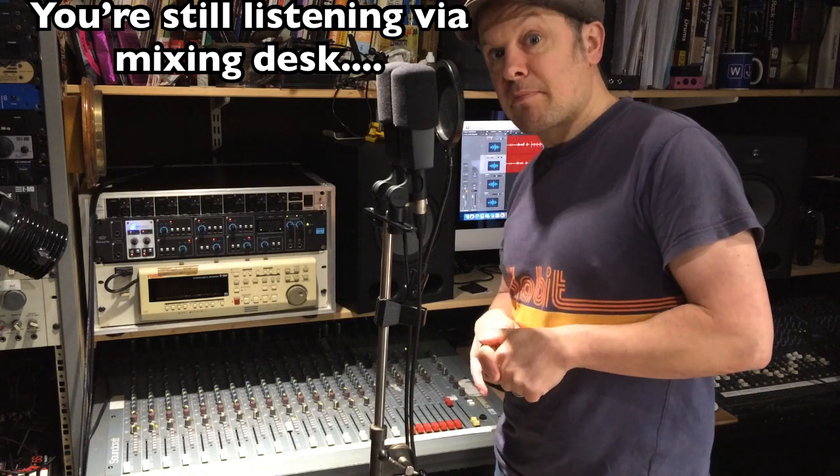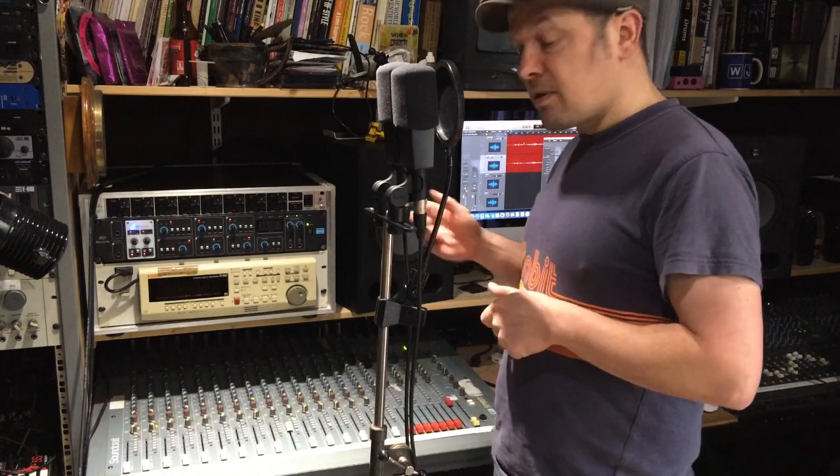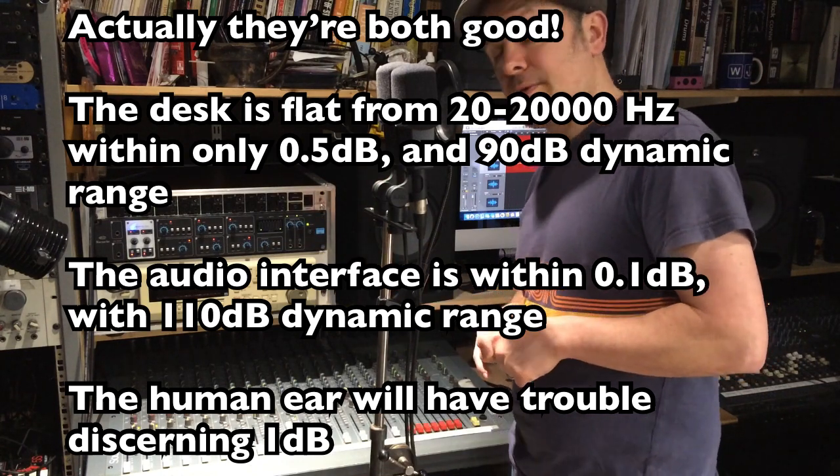When you heard the 24 dB amplified version, you may have heard a Hercules aircraft over there somewhere. But that's the other thing — I'm in my studio, which is reasonably good at insulating sound. Really, to hear the difference between the noise floor on these two things requires careful analysis, and you've got to work out whether it matters or not. Every single object on earth generates noise of its own in some form — even a guitar sat on the wall, the strings won't be completely still. So it's very important not to get too hung up on things, saying you've got to get rid of this because it's no good. The results of this experiment say one of two things: either the sound card isn't very good, or the desk is very good by the standards we expect — and we expect no noise on our recordings, but there's always going to be some.